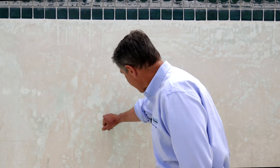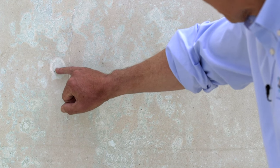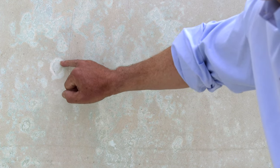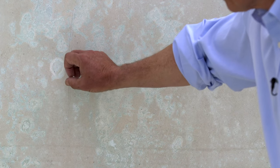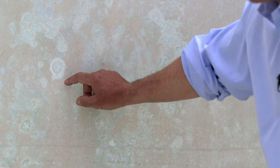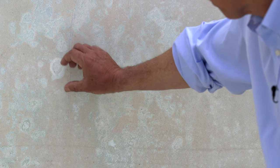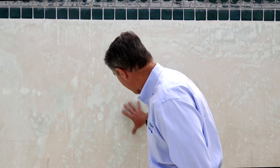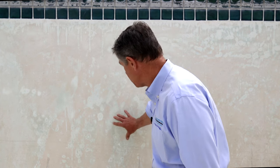Here's a very typical example of what spot etching looks like in a swimming pool. Obviously this pool has been drained and we're getting ready to resurface it. What we see here is a circle — the spot. It originated much smaller around a grain of sand where the calcium hydroxide was, and then it slowly started to etch and leach out the calcium hydroxide in the region all around that sand particle, getting bigger and bigger. Eventually these spots start to connect and you have big areas of etching off the surface.